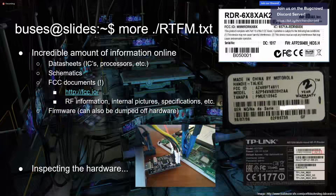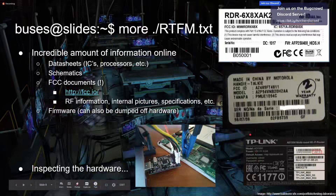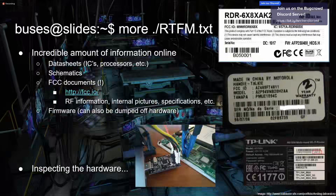How to find information about hardware — this is really underrated. Recon is huge beforehand, and you can figure out basically everything you need to know without actually touching the hardware. Data sheets are a gold mine. They can contain information about ICs on the board, processors — normally there are words on chips, and if you just pipe that into Google you'll find 20-page PDFs with data sheets that tell you whatever you need. Don't worry if you don't understand everything.